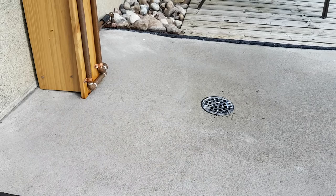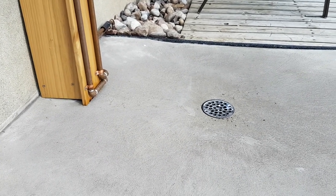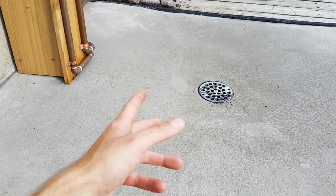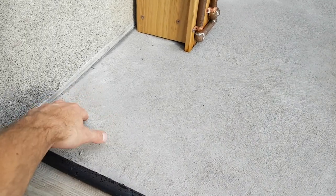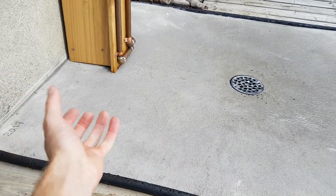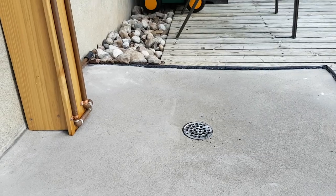I would recommend just putting in a vent. It wouldn't have really taken that much extra time or materials — simply a T-fitting or a vent fitting, a one-inch coming off. You would stub up over here, cap it, notch out the pipe, and that would be the end of it. It just allows air to be pulled in behind that big slug of water going down, so the drain doesn't gurgle.